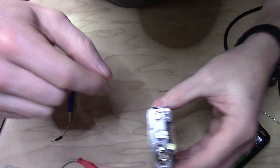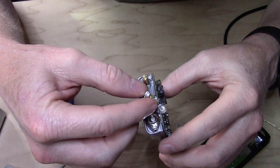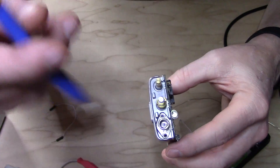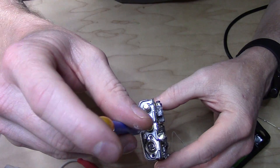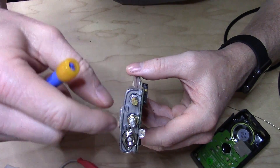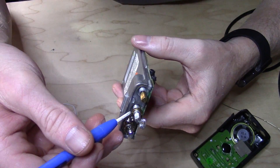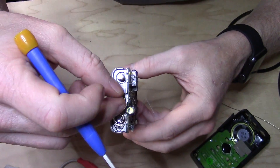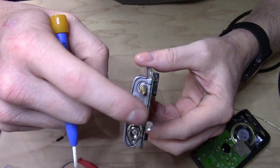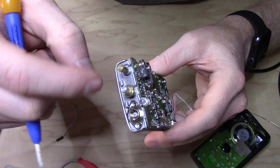The next thing you'll want to do is go in and put your brass rings back. These basically just slip back around like so. You want to be real careful - these are really easy to cross thread. Be gentle with them. Once you get them started and down on there good, you can generally just take a screwdriver, slide it in the slot, and just twist until you get it good and tight. Overall this is a really good design. There are other commercial radios I've taken apart that don't have this - it's basically a solid piece that's actually attaching to the board, so that's a really good mechanically sound design. It protects the board from damage when you bang on these things, because when you drop it these will hit straight on and may damage the case but it's way less likely to damage the board.